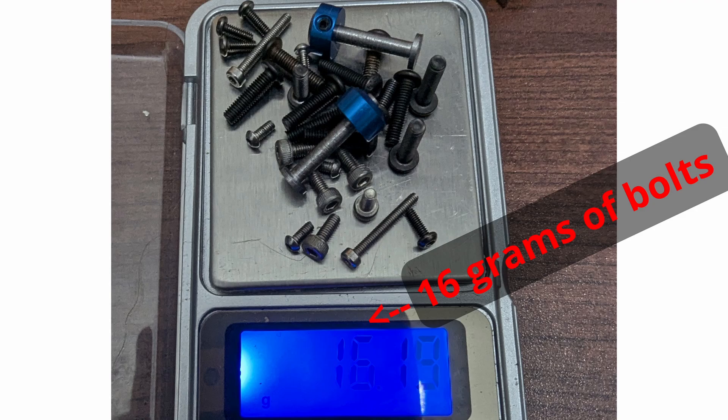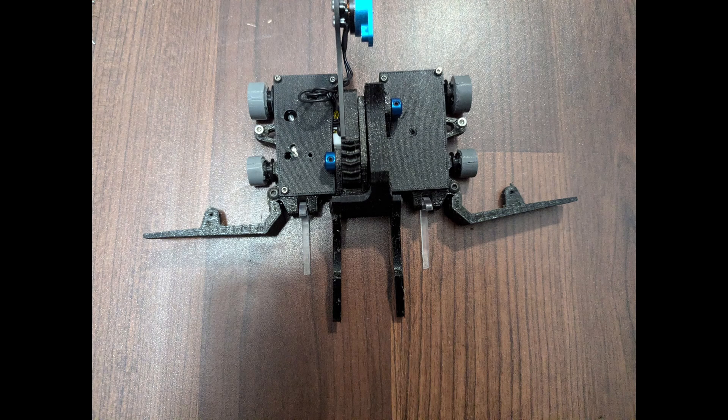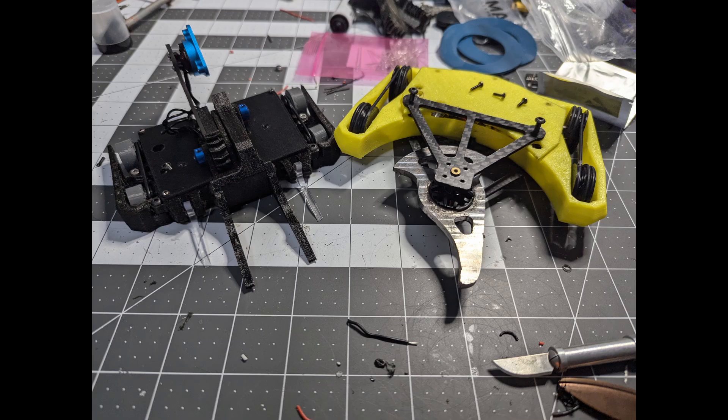Except — I didn't have a top plate. In a desperate final attempt, I spent a very late night reprinting what I could with slightly lighter settings and removed four bolts altogether by printing the flipper arm and forks as a single piece, leaving just enough weight for 2mm ABS lids to keep everything inside the bot. Not the most combat-resilient material ever, but it'll do.